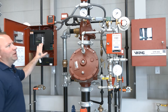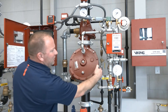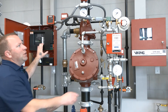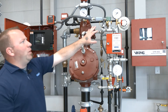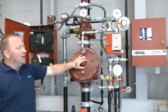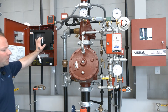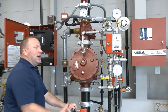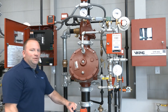When we hit the reset button we have our prime water gauge over here, and because our prime water valve is still in the open position, as soon as the panel goes through its reset procedure we'll have prime water pressure build up on our gauge. Once the prime water pressure has built up on the gauge that means it's closing the valve, and with the valve in the closed position we'll go ahead and open our system control valve, which will allow water to build back up into the riser but it'll be stopped right here at the deluge valve.